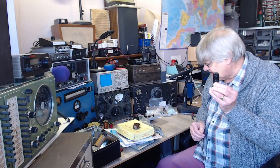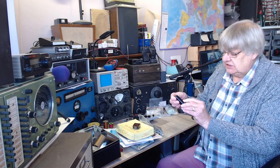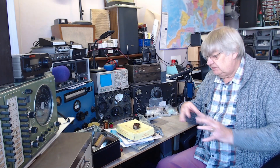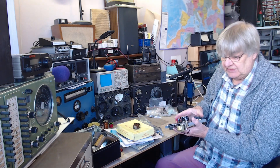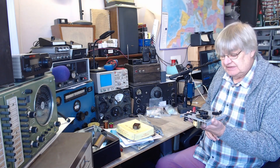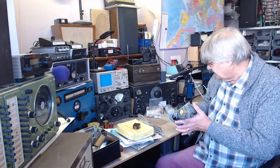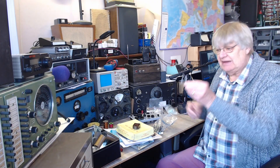All the metal-type valves — the reason for that is the American-style metal valves, like the 6V6, is because the glass ones will be delicate. You're out in the field transmitting and receiving, and you've got to pack the thing away. There are clips — because when you've built the box, when you shut the lid you've got to take the valves out, which is a bit of a pain for people out in the field. But otherwise the box is going to be much bigger. So you take the valves out and clip them in the lid. I've even got the Terry clips in here — I really have got just about everything that you need.